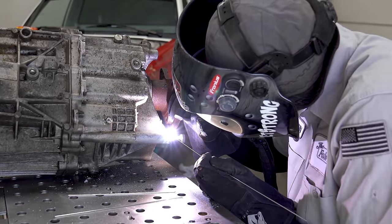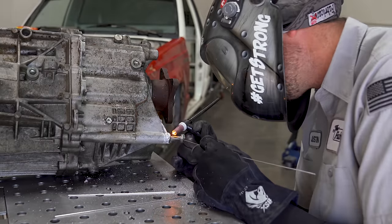My technique on this one is I'm basically padding up a bunch of aluminum very lightly, just getting it to stick to the top. After I have a few beads in place and I've rebuilt that section, I'm going to go in there heavy on the amperage and let that aluminum flow — basically melt in there, go a little bit too hot — but I'll still poke in a little bit of aluminum here and there to make sure it doesn't fall away and that we're maintaining that buildup. This section around the edge only needed a single pass. I'm making sure that the dabs are relatively heavy and that the final result is each dab sitting above the area, because we're just going to grind it all back down. Make sure you let it cool down between each pass, since there's not a lot of surface area on there. Once you're satisfied you have enough metal on there, continue to build it up or at least do another buildup on the outside of it.